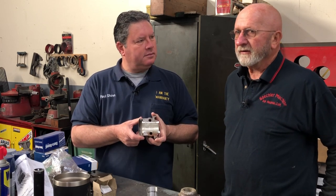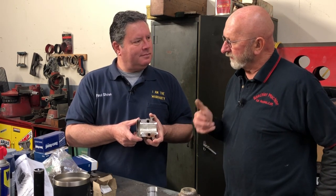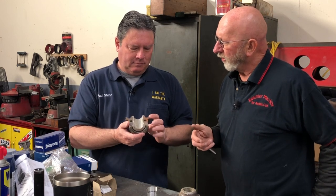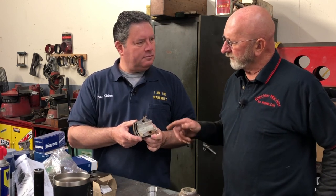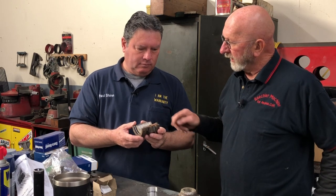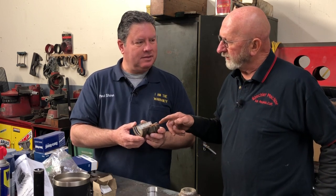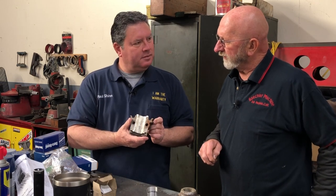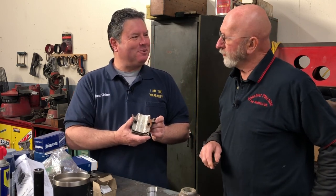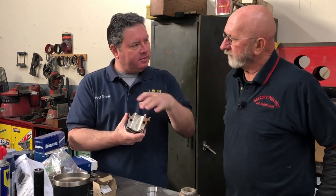He thought that percentage — 87% tin — was the right formula. It's basically mostly tin, with some copper that helps the tin stick to the steel or cast shell. These shells are made out of steel, and Babbitt will stick to steel if it's tinned properly — better than it does to cast iron. Cast iron Babbitt doesn't stick to unless you coat it with brass or copper first. Usually you'll see a series of holes bored into a block, and that's to get the Babbitt to flow in and hold — give it some grip.